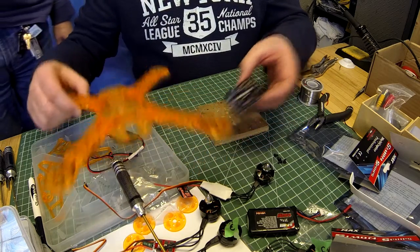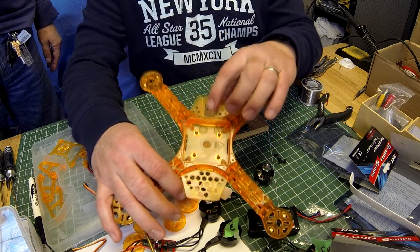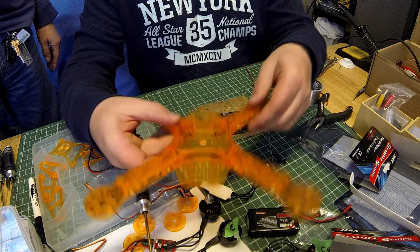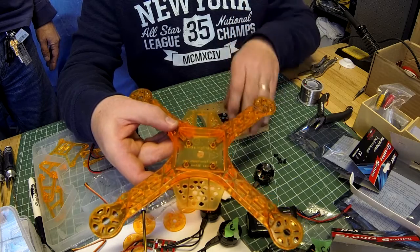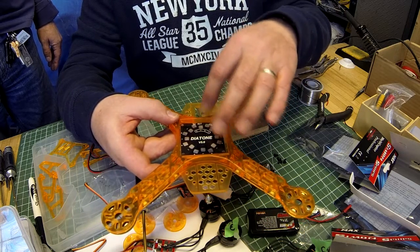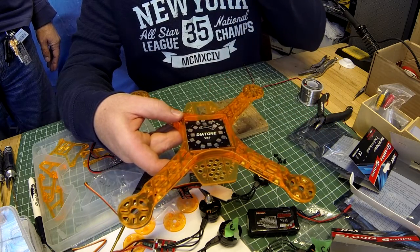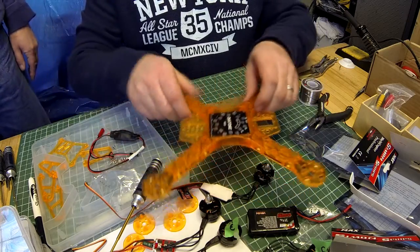And the front of the frame is obviously this, because that would be where the servo goes on the FPV edition that tilts your flight camera when the quad's going forward. So this would be the front of the quad, so we're just going to mount this that way so our filtered power sources are at the front like they should be if you're running FPV cameras in the front. So we're going to screw this back down and tin our pads and stuff.